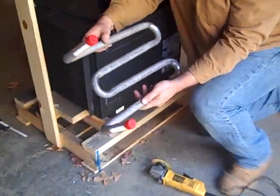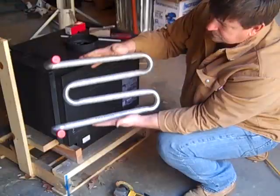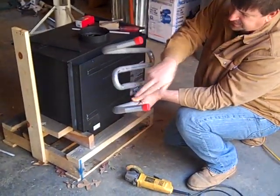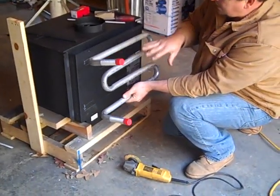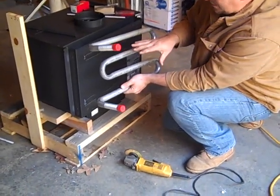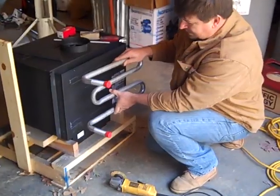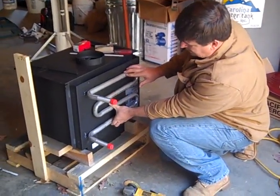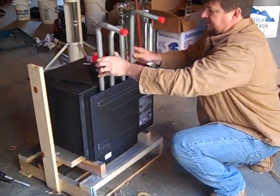What we're going to do is use a coil from Hill Coil — it's a double-looping coil. I went with a double loop over a single loop because we're not going to be inside the firebox, we're going to be up against the firebox. The double loop gives us more surface area.